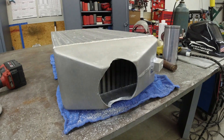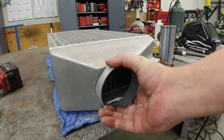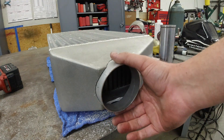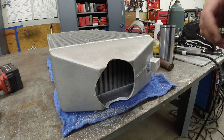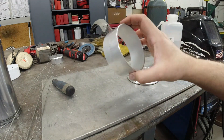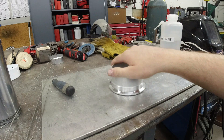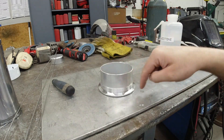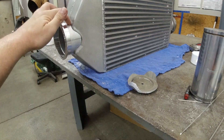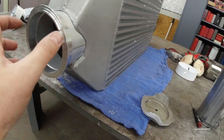See if this 4-inch fits in there. Oh my goodness, that is like frickin' perfect. Gonna do a little shaving in here so I can get it in there farther — it's gonna look perfect. About ready to start welding. Got a piece of 4-inch here, probably about 2 inches long roughly. I've deburred the edges. We'll weld here on the table just because it's easier to weld a little bit and turn it. Then we'll take it over and make some marks and cut some of this stuff off on the inside so we don't have to grind it down later when we pour it.